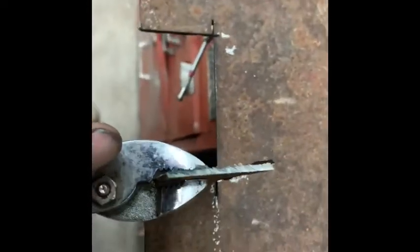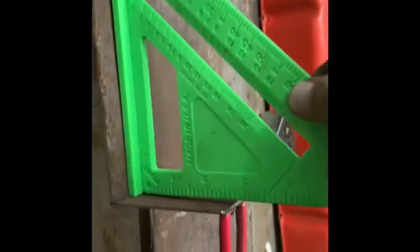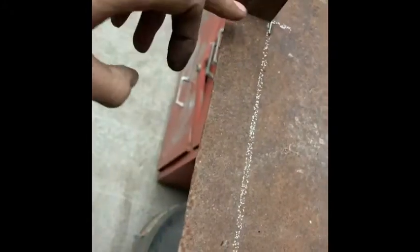We got each end cut all the way, cut all the way here, and cut all the way here. And then we've got this ground cut, almost all the way through. If I didn't cut too far it'll break, we should be able to just start to pop a little bit. I'll get those moved over a little bit more, take my square — obviously they're not all the way there yet — so get those pushed all the way over. Then I'll burn them in right here. It's not got a lot of weight, but a couple of good tack welds.